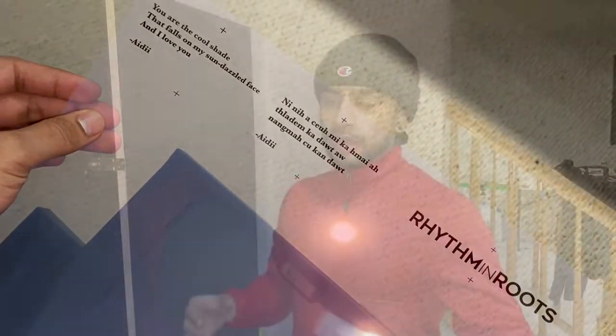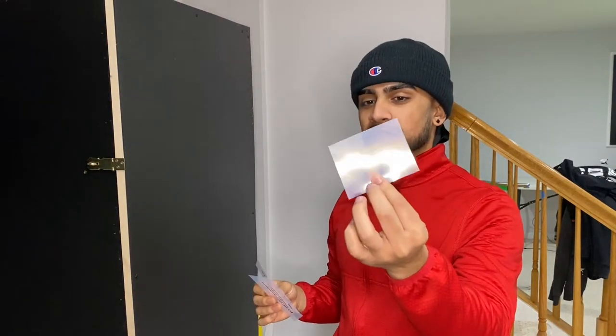The next step is to go ahead and get your transparency films printed in the correct sizes, then expose them. You want to choose the right mesh count and grab your screens. In this case we're just printing letters and words — even though they're super tiny, I believe a 156 mesh will print it properly because that's what I used last time.